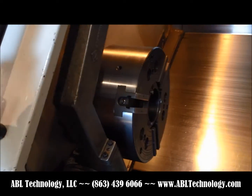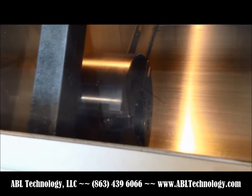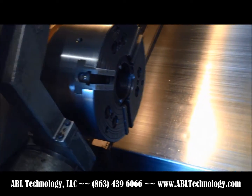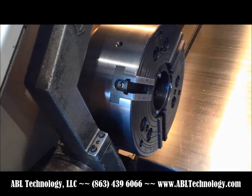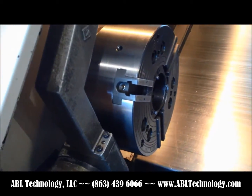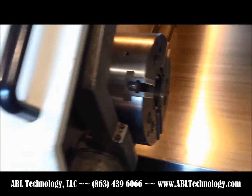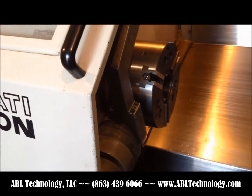The machine has a 10-inch chuck and is rated at 4,000 RPM. However, this machine does draw a fair amount of power, and since we're running with a phase converter, we're not able to run it higher than 1,000 RPM without tripping out. So we're going to run it at 500 RPM to start, then take it up to 1,000. It's a nice, quiet spindle.